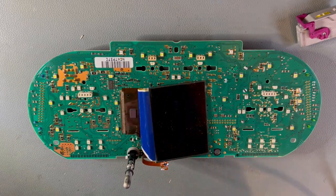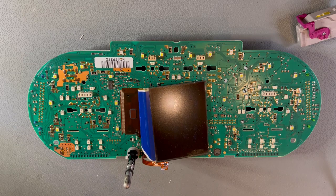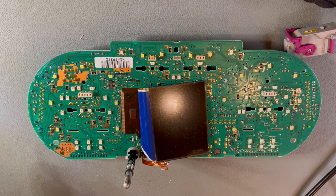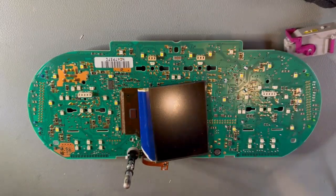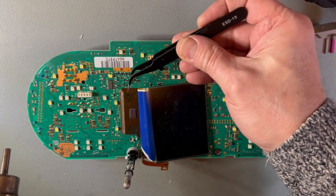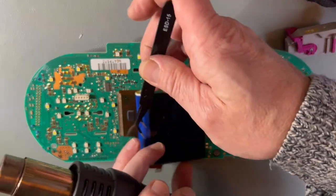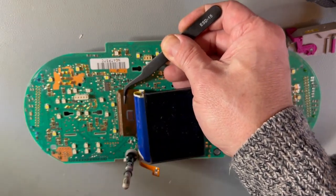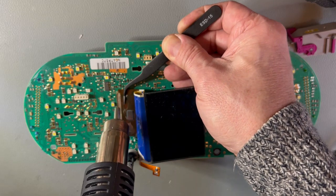Okay, so we turn on the heat gun. I'll typically use a pair of angled-tip tweezers to get underneath the ribbon and start to lift it off the board. We're going to put this underneath the ribbon, being very careful not to scratch the board — it's quite tight underneath there. Sometimes you have to lift up a little, get the blades underneath right near the pins where the ribbon is strongest, and then begin to heat aggressively along the ribbon.